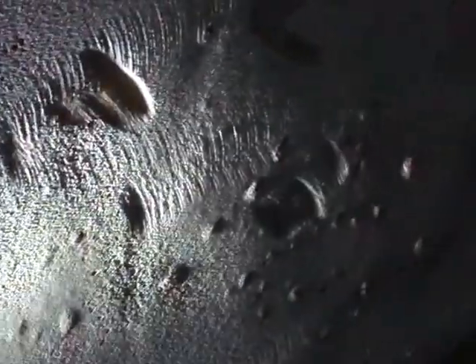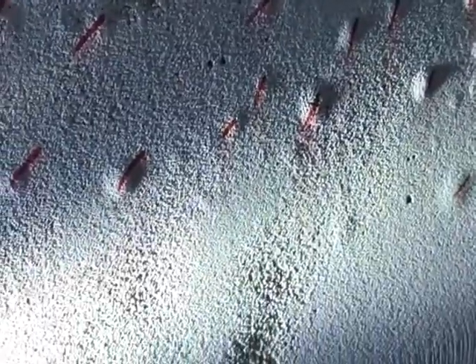Underneath each of those bumps at this stage was mostly dry fiberglass. The moisture got in but hadn't reacted with solutes, glycols, or any uncured resins — it just caused separation of the gel coat, which blisters up when the boat comes out of the water. They'd dry out, then a few days of nothing, then all of a sudden — whether it's temperature or humidity I don't know — another batch would appear. In the end, three to four weeks on the hardstand grinding and drying. Before we started refinishing, we waited until we had five or six days of all moisture readings below ten percent.